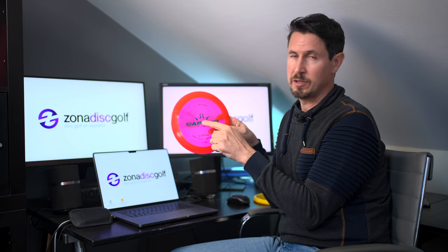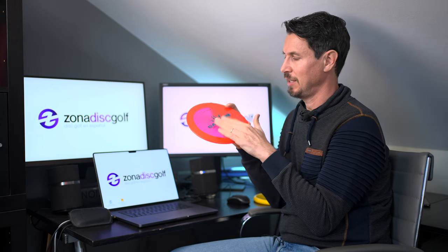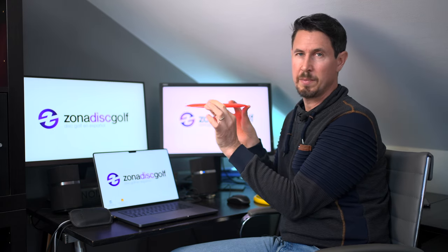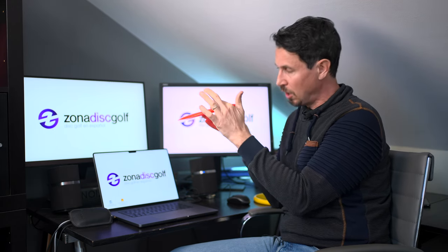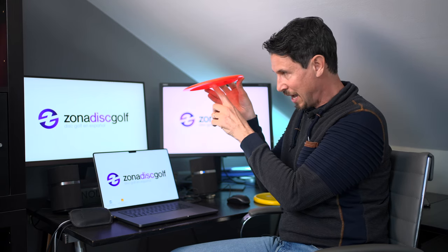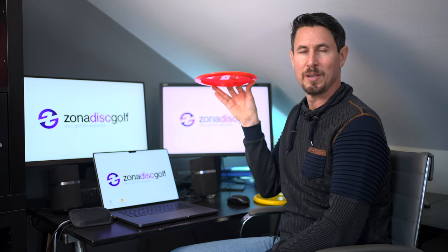The position of the center of gravity is easy to see on the plan view, because it's symmetrical, so it's in the center of the disc. When we see the side view, it's actually not in the disc — it's below the disc, because there is some material here, but the rim is heavier and it's below the plate. So the center of gravity would actually be a little bit below the disc, in the air below the disc.